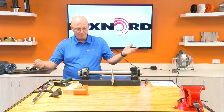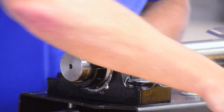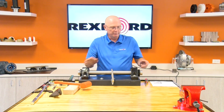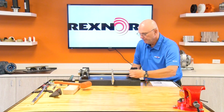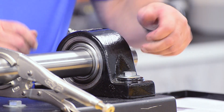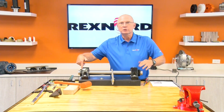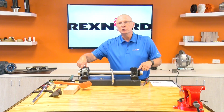Pretty simple — nothing complex about it. I'm going to line this bearing up. Always apply pressure to the housing and not the bearing. Get it lined up, tighten your bolts — that's the fixed unit done. Go over to the expansion unit: center the cartridge, since this cartridge is allowed to move a certain amount. Center the cartridge in place and tighten the mounting bolts. Then align, and go through the same procedure: take it hand-tight to zero, then one to one-and-a-quarter turns, tighten the two set screws, and you're done.